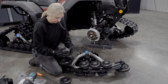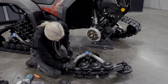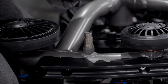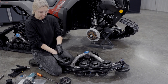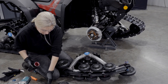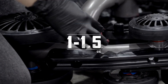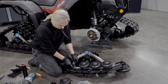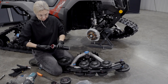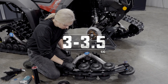Once you've got the wheel off, it's time for maintenance and replacement. Here we're replacing the entire wheel assembly, which includes the wheel bearings, seal, and cap. Start by cleaning the wheel shaft with a dry cloth. Next, apply new lubricant to the wheel shaft — for the Camso X4S track system, apply 1 to 1.5 cc over the entire circumference and width of the wheel shaft. Then install the new seal and apply 3 to 3.5 cc of grease on the wheel seal's V-shaped groove. Your owner's manual will tell you the exact amount of lubricant to add for your particular Camso track system model.